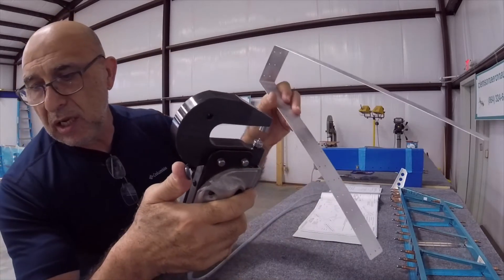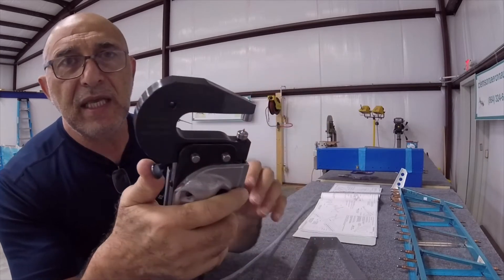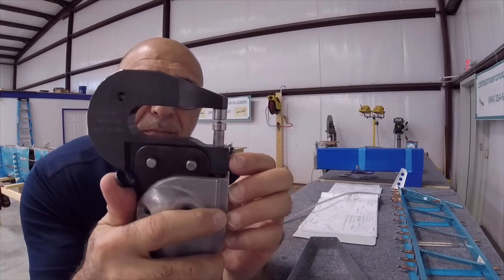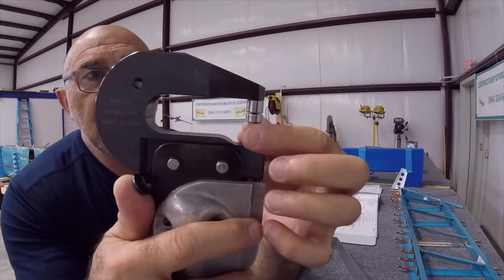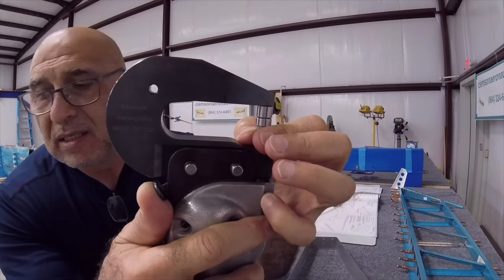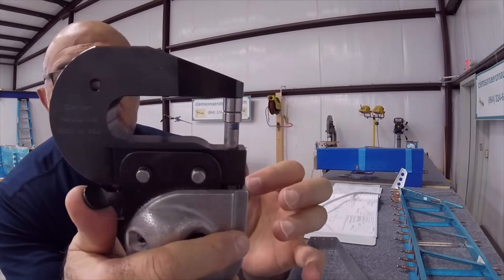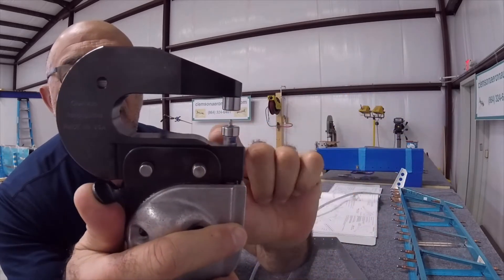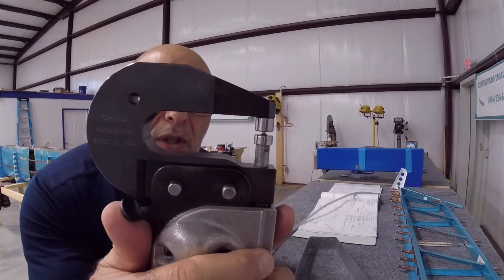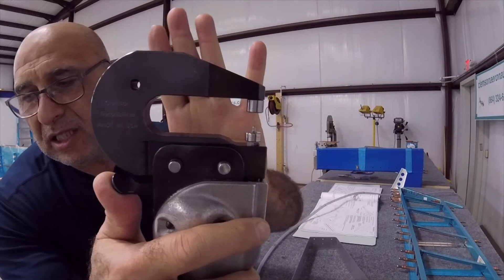When thinking about this piece, you want the cone shape pressed in from the outside of the airplane to the interior of the elevator. I've retracted this pin down so when I push it, it goes all the way up and is still free — not touching. Now I'm going to tighten it: push it all the way, tighten it until it doesn't go anymore, then turn it a complete half turn after releasing it. I have marked the flats, snuck it up just a little, and now have a full half turn. When I push all the way, you can see it flexing ever so slightly, because this yoke doesn't flex much anyway.